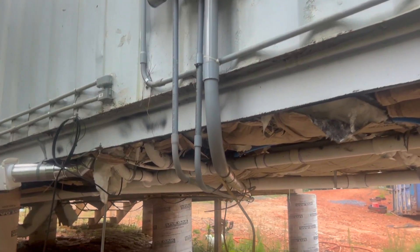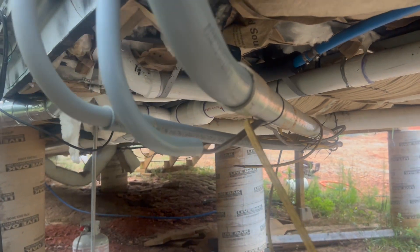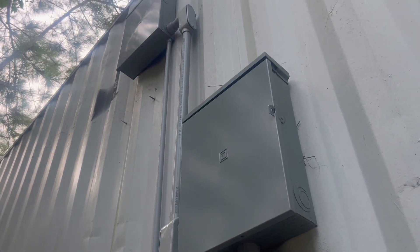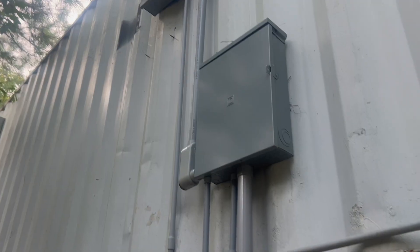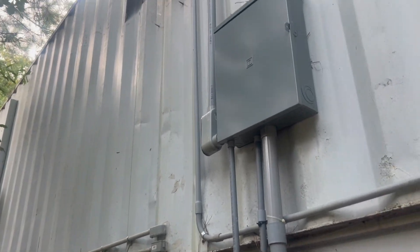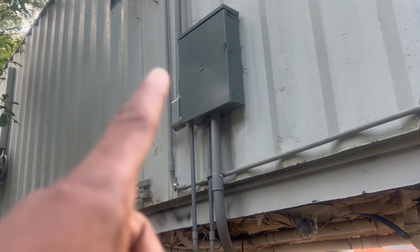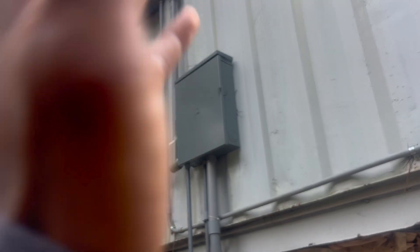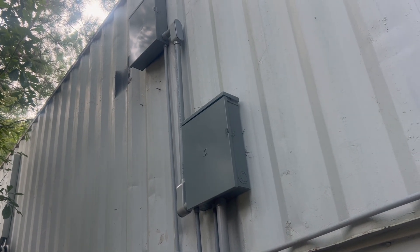So these are the panels here. I still have this wire dangling because I have an extra line going to the storage container that I'm going to hook up eventually. I don't know why my father hooked up two panels here, but there's a reason for it — maybe I could do another video on it. But everything's running good. This run is about 70 feet from the panel all the way to where the inverter is, and we use number six wire to pull the load from the inverter into the panel box. That's basically what's going on here with the solar system — totally off-grid.